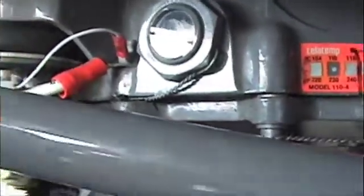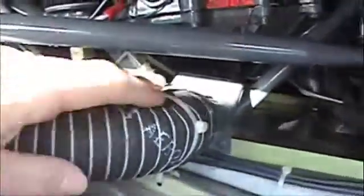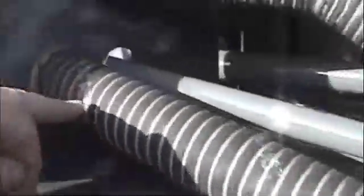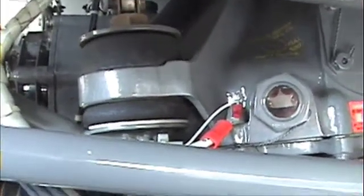Also, you're looking at the gearbox — there's wiring right here. Look around and make sure there's safety wire attached and no leaks. Coming in, underneath the main rotor gearbox is the main rotor chip detector, which detects any metal particles in the gearbox. Make sure those are fastened — we're going to test that in a second. The wiring harness should be nice and secure. This hose right here comes all the way back to the fan, blowing air onto the gearbox to keep it cool since it's in a very confined area. Here's another main rotor gearbox mount and bolt — check the condition of that.